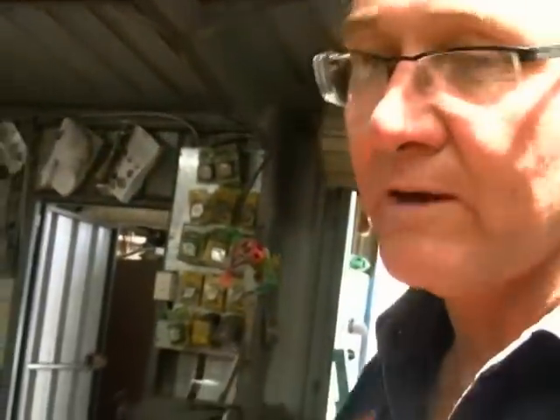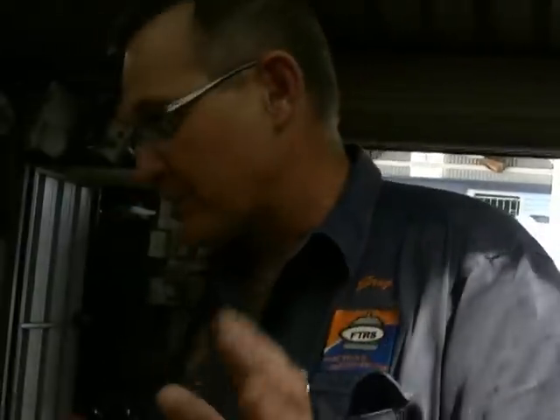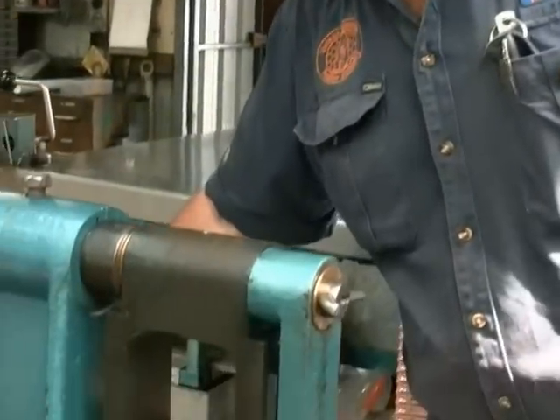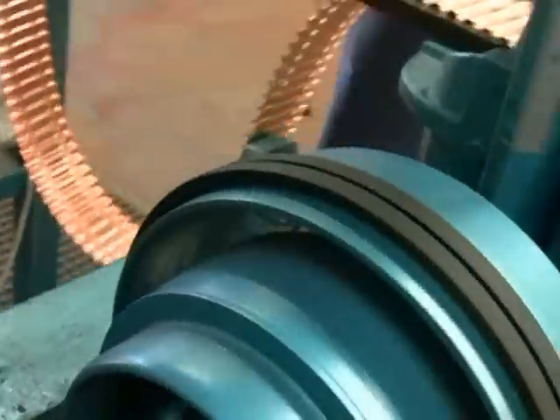This little machine was built in Sydney in 1930. It used to be operated by Johnson Brothers at the same address from where I bought it, on Parramatta Road, Ashfield. We've extensively restored the machinery — re-bushed it, re-bearing, new motor, new gearbox, everything that had to be done. Inside here we have a tapered cone cast iron clutch, much like veteran cars actually, which when you pull the lever, engages it. The weight of the flywheel keeps it going.